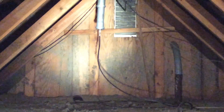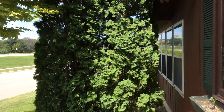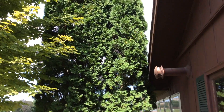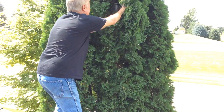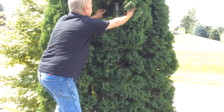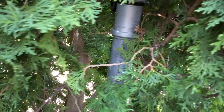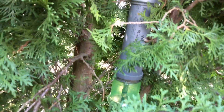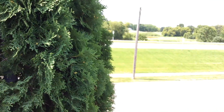When I first got this it was wintertime so I put it in the attic. That is not recommended. Later I got it outdoors and put it up in this tree. I want to get it away from noise sources. It did not work well in the attic at all — too close to the noise sources in the house. Now I have it out away from my other transmitting antennas. It's not all that high, but being away from noise sources makes all the difference in the world.